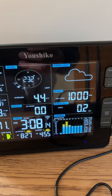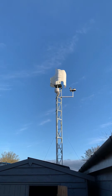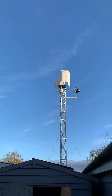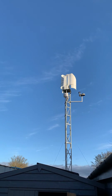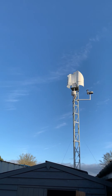We're doing about 3.5 to 4.5 meters per second of wind, so let's have a quick look at what's happening on the wind turbine. We've got about 4.5 meters per second and the turbine just started. Anything between 3.5 and 4 meters per second it doesn't really go, and then as soon as the wind drops off you get quite significant fall-off of speed — that's just because of the gearing.